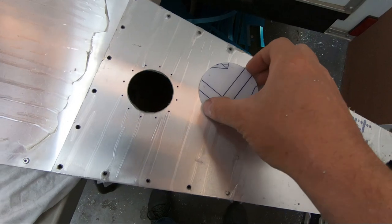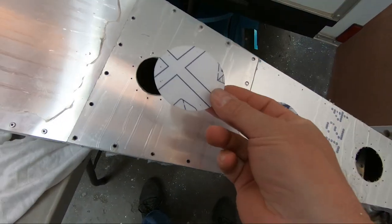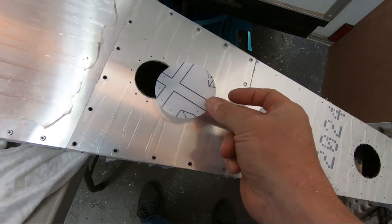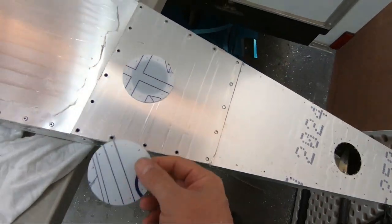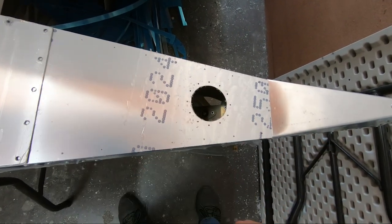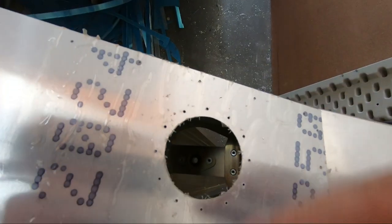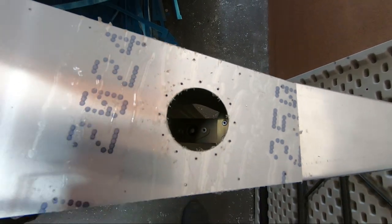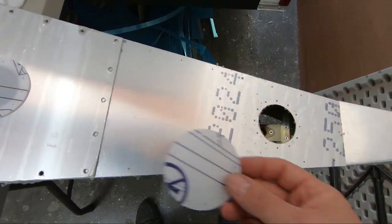I went and cut out these circles and pre-drilled the sixteenth-inch holes for the sight holes. One is going to mount on the back side of here and get riveted into place — the holes line up nicely. I cut a second one for this location — they're exactly the same size, so I made them universal. You can now see down in there and see the bearing mount for the rudder, and we should also be able to see the bearings and the rudder horn that will attach the bottom of the rudder once this is installed.